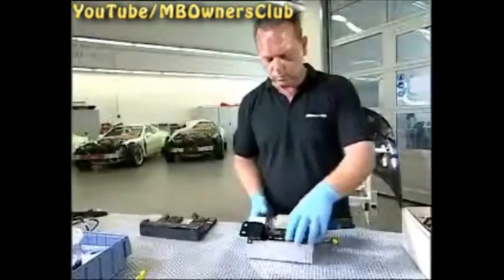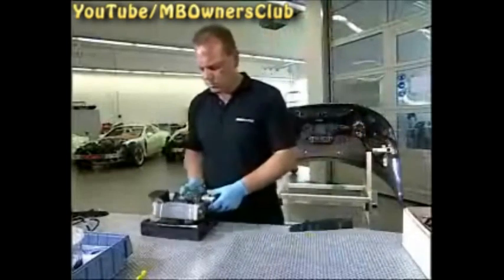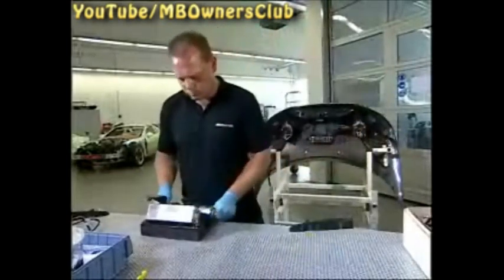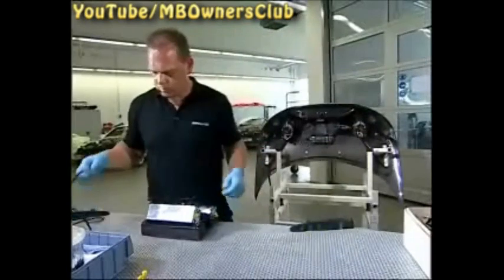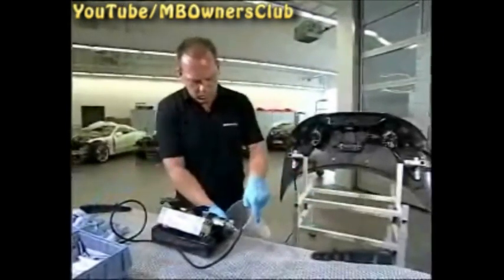Now the pump and the hydraulic line must be bled. The bleed reservoir should be full. Place the pump with the distributor block upright. Beforehand, make yourselves a cable with a switch. Attach the plus and negative connections to the pump. Use a container and power up the hydraulic pump.